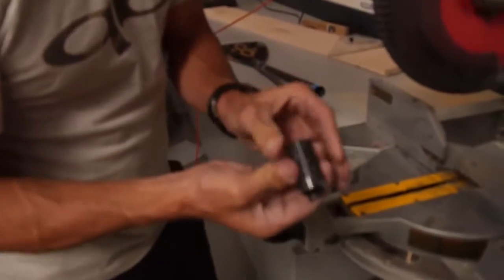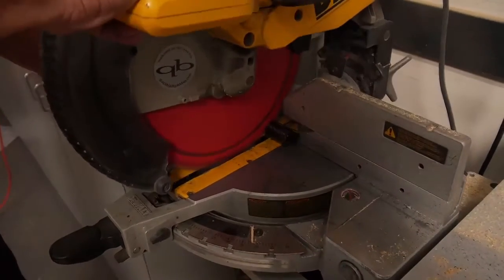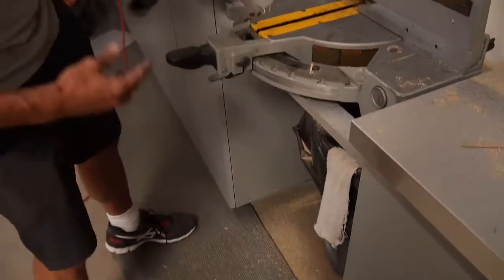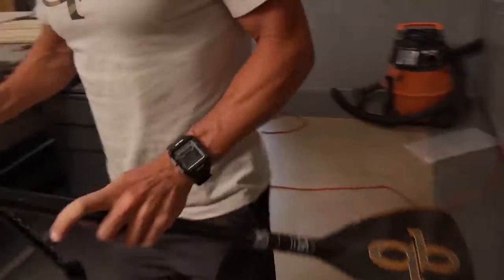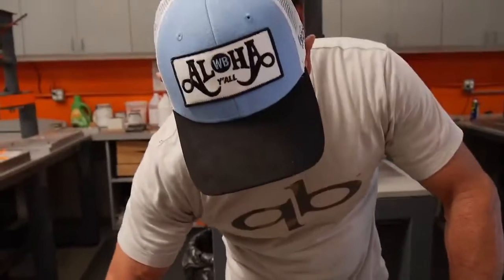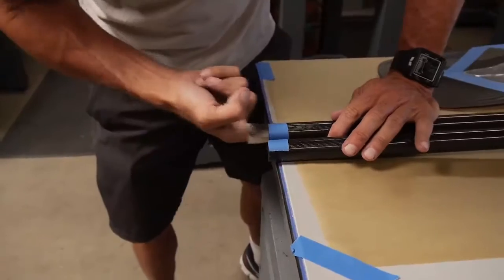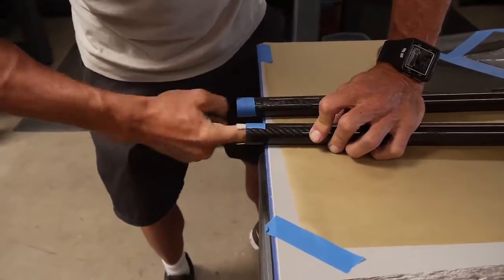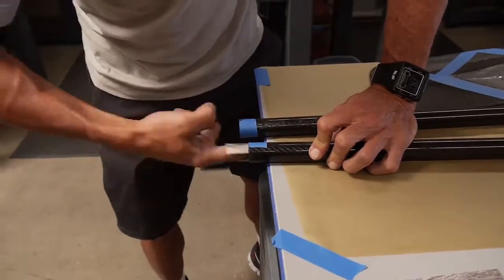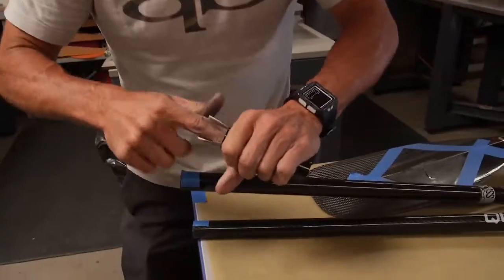You can see that's the piece that was damaged — take that away. Make sure you get the carbon dust out of there. Next, you're going to want to rough up all the mating parts. Take some sandpaper — you can use 80 grit or 100 grit. You want to rough that up so you get a nice good bond. You want to sand inside of this also.